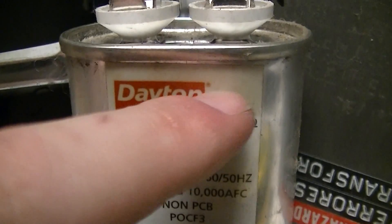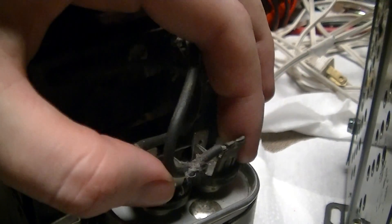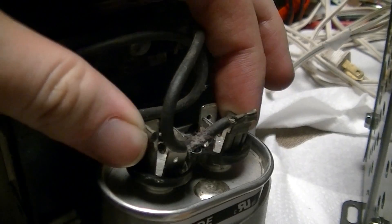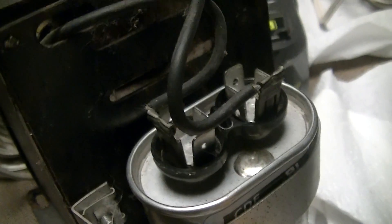I don't know what the original cap was. I also don't actually know the potential across these terminals because I've never measured it — I should do that. Now that I have some 100x scope probes as another Christmas present, I can. I know the open-circuit voltage was about 370 volts AC after that capacitor died, but given that it's a tank circuit operating at resonance, the actual voltage is probably higher than that.